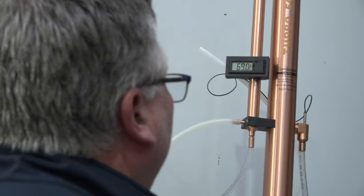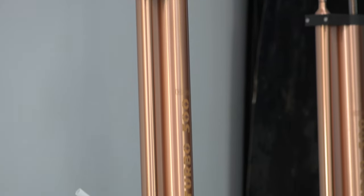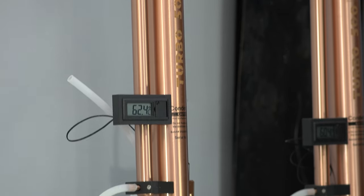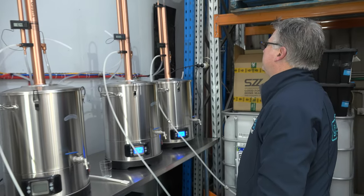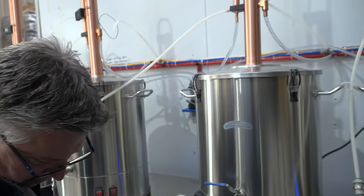We always start here with our distillation kits. Pretty simple process — standard distillation everywhere around the world. You take your alcohol base, heat that up, that turns the alcohol into a vapour, that vapour travels up through the still, the still has a condenser running around it, that condenses the vapour back into a liquid and you get a distillate coming out the other end.